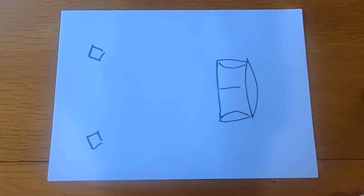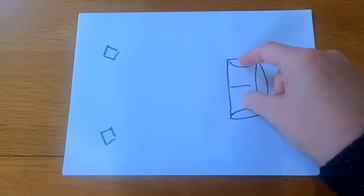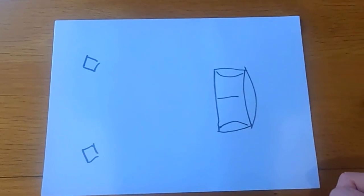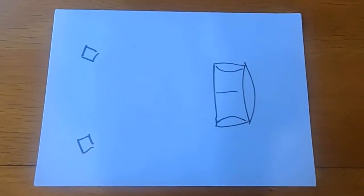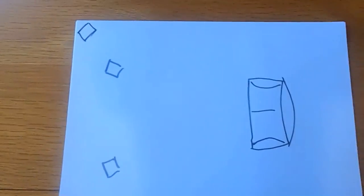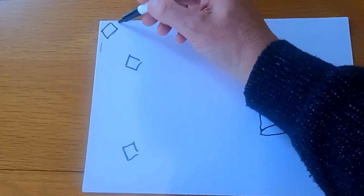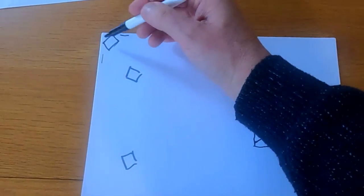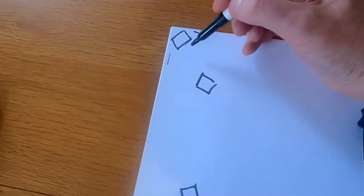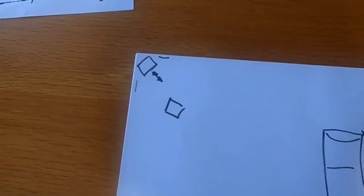Okay, so this represents the perfect room. We've got to start from the perfect situation, because that's the best way to show what you're trying to achieve. That's the size of your room. The seating position — usually the best place for speakers is roughly like that, so you've got the usual sort of equilateral triangle. The surround sound AV approach would tell you the best thing to do with a sub is to put it in the corner, where it uses the two walls to reinforce the output, almost acting a bit like a horn.